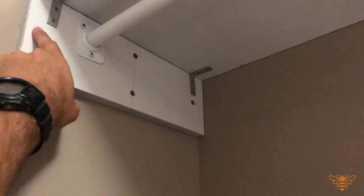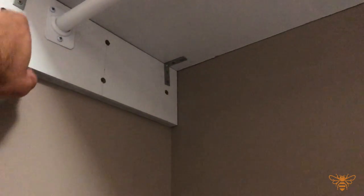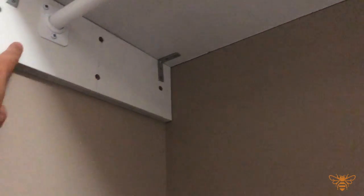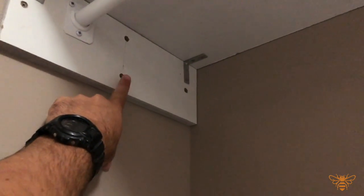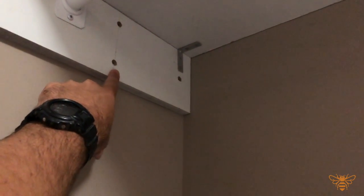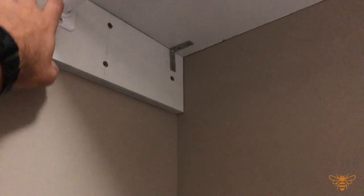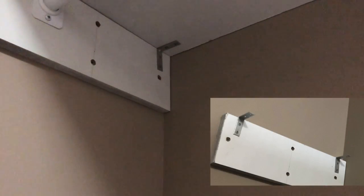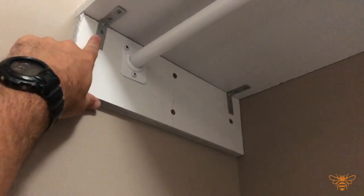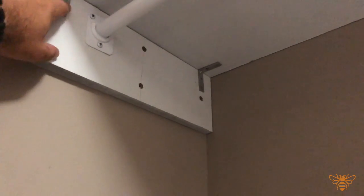Then I came here with just a small drill bit, put it where I wanted it level-wise, and just tapped each hole so I could see where it was going to go. I pre-drilled these screw holes to go into the studs, put those in, put my anchors in, and then added these brackets on before I added the shelf, just to make it a lot easier.